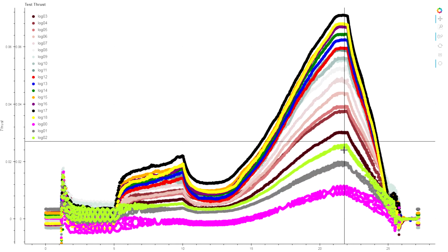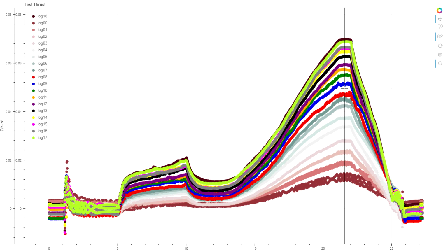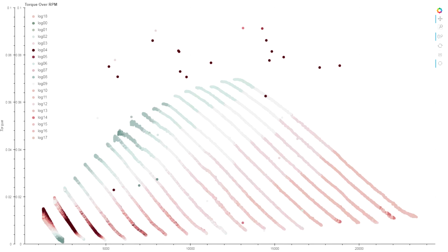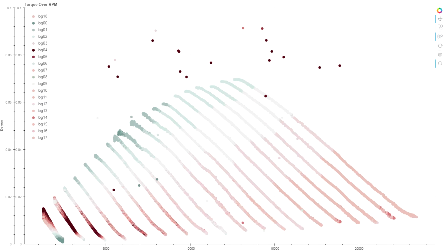All of these big gaps here in the middle are basically gone, and until we hit the really high RPMs where noise is a bigger problem, we're seeing much better results. And in the efficiency chart, it cleans things up beautifully. Compare again to that first one, all of these results that are stuck next to each other go away, and you can see we get a much cleaner value spread. Down here, we don't have these chunks of mysteriously high efficiency in the mid-band, except down at the very low RPM.